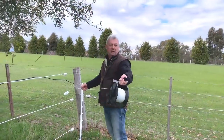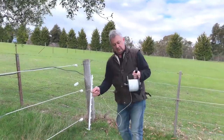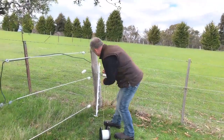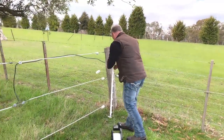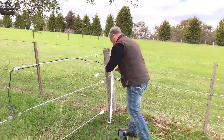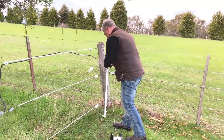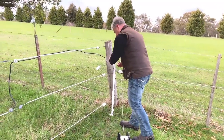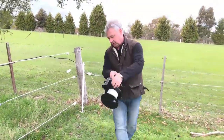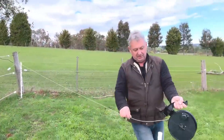I'm running a three-wire grazing fence. I'm using a 200m roller of pre-wound braid. I'm just going to tie off the top where I'm starting from. Just make sure there are no loose ends or anything that's actually going to touch anything else, because it shouldn't be electrified. Off we go across the paddock, clipping in as we go.